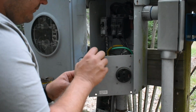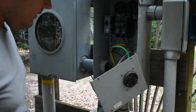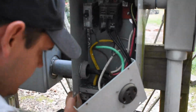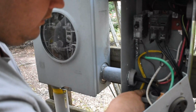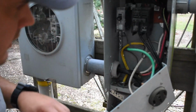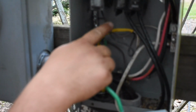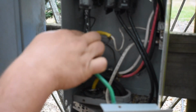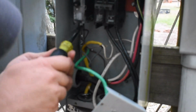All right. Roll that out of the way. All right, that comes in. Go ahead and undo the wiring. Now if you get in close, I'll show you the black wire is your hot wire, and then your white wire is your neutral, and ground goes to ground, of course. So it's only 3 wires, very simple, 110 volts. So I'm going to replace this whole wire. So we go ahead and take this loose again, confirm that it's off.